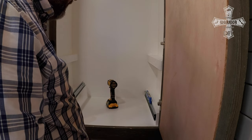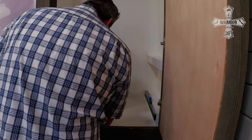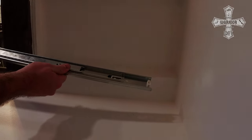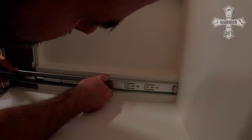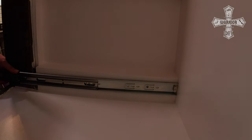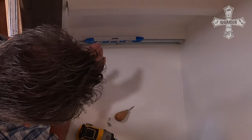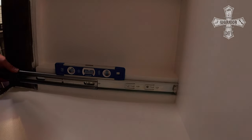On this side I'm not going to be removing the center piece that attaches to the drawer — I'll go ahead and leave it on there and set this in place. Now I want to make sure this is level, because if this piece is off — if the bubble is off and it's sloped down or sloped forward — then you might have a tendency for your drawer to slide on you.